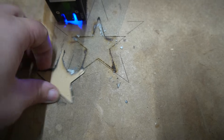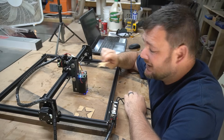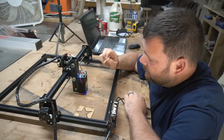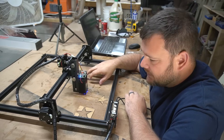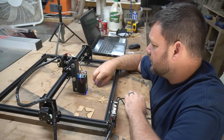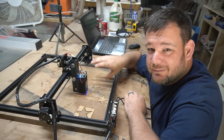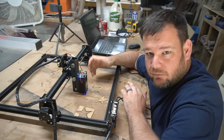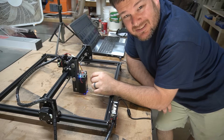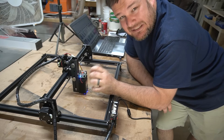I lit the paper on fire — but it did cut it. Look at this, got a star. So if you want shapes with a burnt singe look, I recommend it, but if you dialed in these settings I'm sure you could cut it fairly well. One of the main differences between budget lasers like this and higher-end lasers — say the Glowforge — is the software. These budget lasers take a lot more time to dial in speed settings, whereas the higher-end lasers have those presets figured out for you. One last test: let's see really how powerful this is and how deep it can engrave.